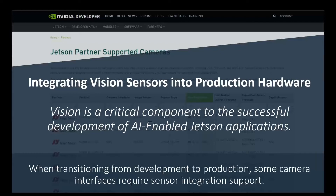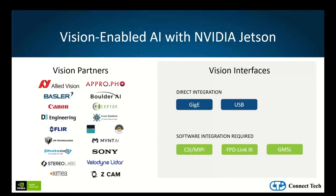Depending on the chosen vision interface, some mechanical integration challenges can be introduced as well. NVIDIA has a wide ecosystem of vision-based partners, pre-qualified to have sensors compatible with Jetson software. ConnectTech has identified and worked with many of the major manufacturers listed in NVIDIA's camera sensor partner ecosystem. When customers set up to integrate vision sensors, there are a number of interfaces to choose from. The ones we'll be focusing on today are Gigabit Ethernet or GigE Vision, USB, MIPI-CSI, FPD-Link 3, and GMSL, broken up by level of complexity for integration.